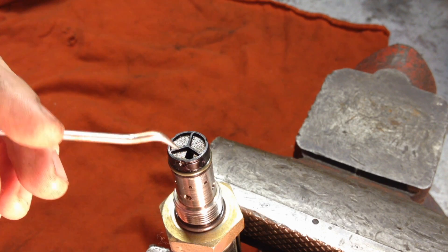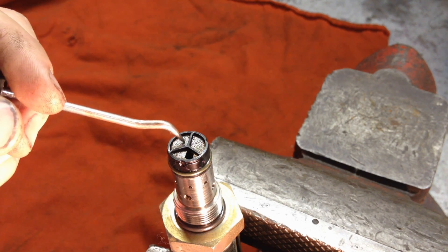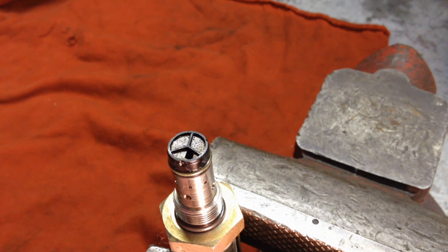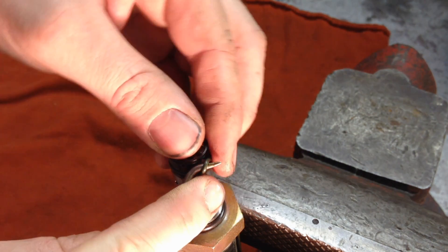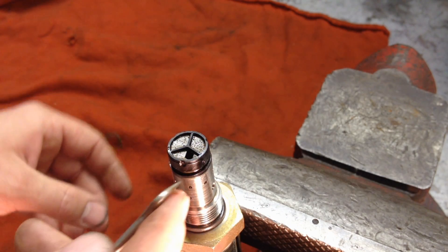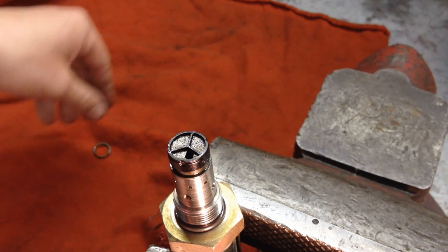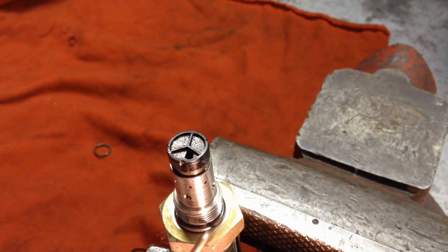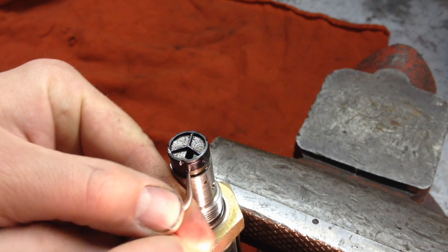Some screen damage can be subtle — just a sliver of metal that blows right through cleanly, so you really have to look carefully because it may not be this obvious. After checking the screen, look at these O-rings here. There's a backup Teflon-type ring that supports the other one. I've seen those blown out. The outer ring is just an oil control ring for external leaks and those usually don't go bad — it's the inner ones where oil can get past the screen.